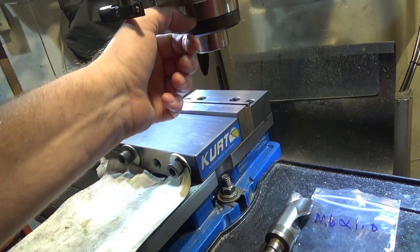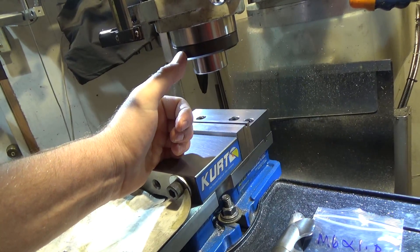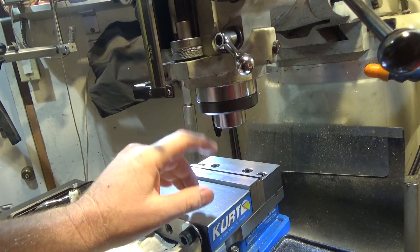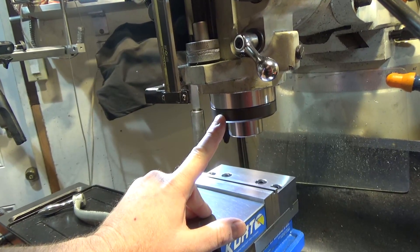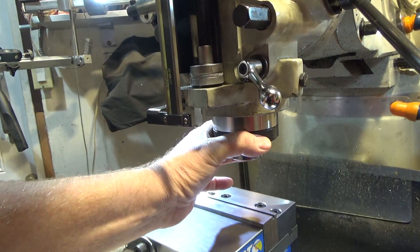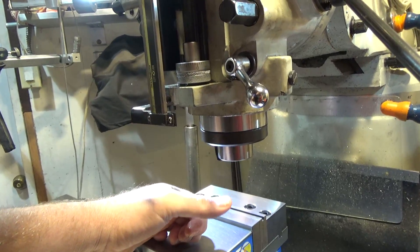What I'm going to do to get this back in alignment is put a mark on the threaded portion of this nut on the bottom, so I can count revolutions and put it right back where it was from the factory. Some people use feeler gauges to measure the spacing and reproduce that exactly. The Bridgeport guys say somewhere around three thousandths or less; I've seen some say six thousandths or less. When I measured mine it's around fifteen thousandths — but rather than reproduce that, I'm going to mark both pieces and count revolutions when it unscrews.